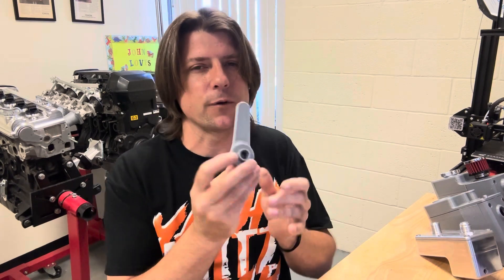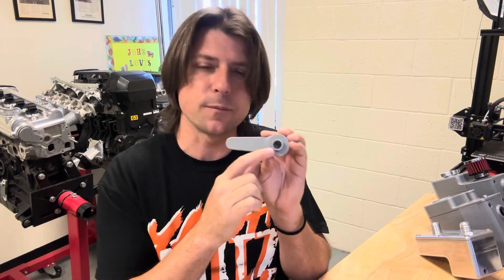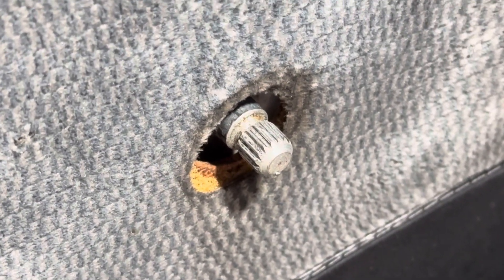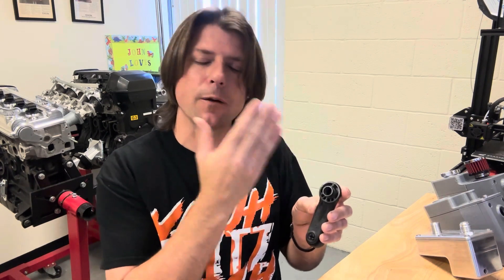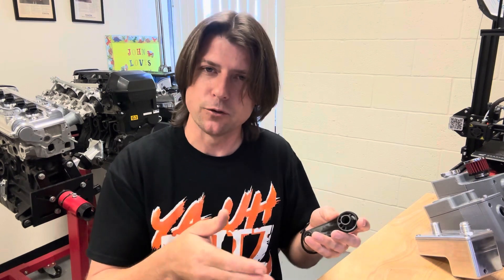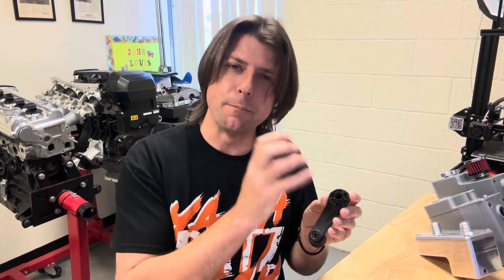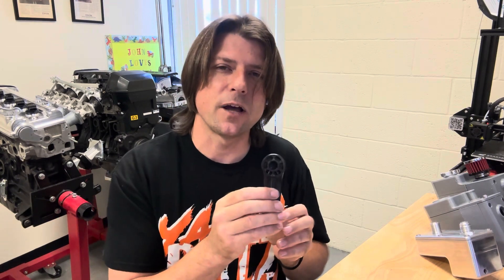The first part of any design is figuring out the original geometry of the factory part, the cutaways for the clips that hold it, and the most important and most difficult part — the spline on the inside that connects to the window crank on the door. Because the factory crank is made through plastic injection molding, they're able to create sharp teeth on the inside. It's not that easy to do on a CNC machine. The only type of tool that can cut sharp corners would be what's called a broach — a process of scraping a shape through a length of material using multiple different tools to take a round corner and create a sharp corner. I could machine a bushing, have it sent out, have it broached, and have those bushings pressed in here. But I wanted to keep it all in-house, keep it simple — less pieces, less problems. Let me show you from a design side what I'm going to try to do to create the spline on the inside of these window cranks.